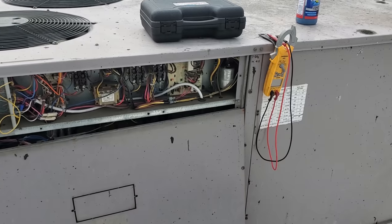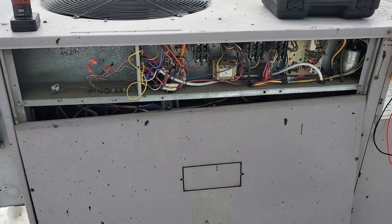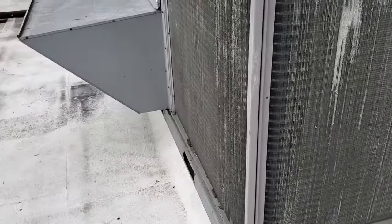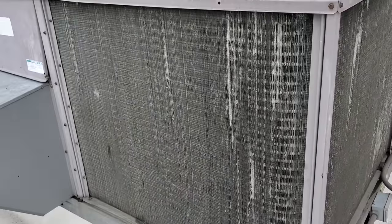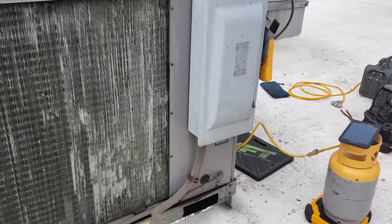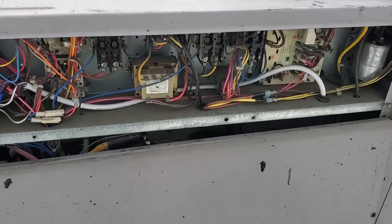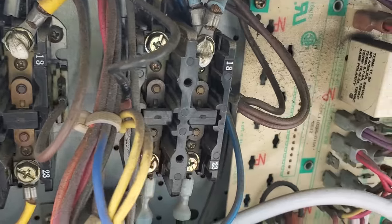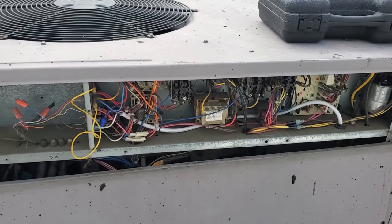The unit is doing pretty darn good. That first stage was a little low on refrigerant. I did a leak search and couldn't find anything at this time, so we're going to tell them to keep an eye on that. The condenser is pretty damaged — there's only so much we can do with that, but I believe that will answer for why the head pressure is a little elevated on both circuits. I'm going to go ahead and replace these contactors — they are really, really burnt, not looking good at all. So I'm going to replace all three of those, and this run capacitor is testing bad too, so we're going to swap that out.